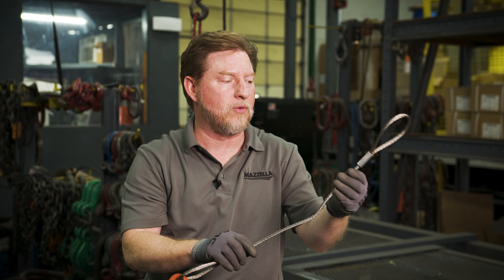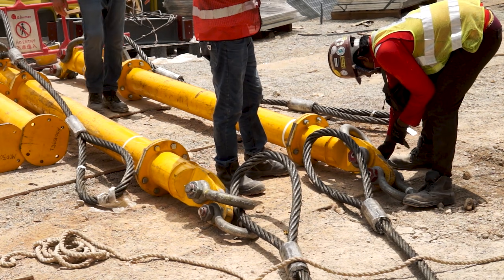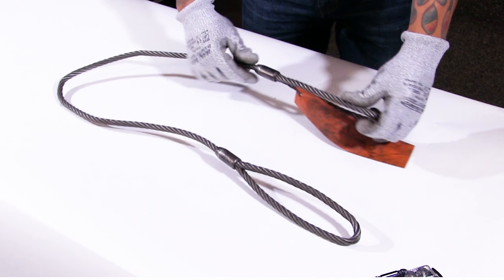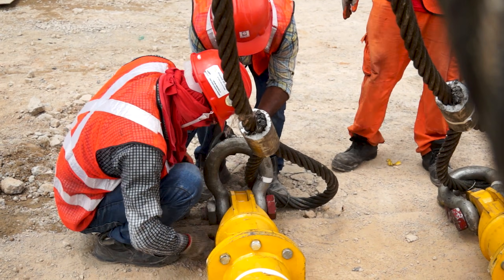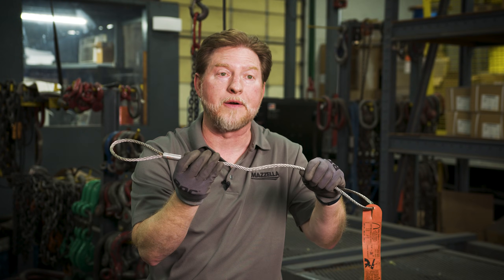You could still achieve a five to one design factor with a fold back. But the largest issue is if you're not doing a proper inspection on this style of sleeve, it may have a tendency to crack or wear if not done properly. Maybe you're dropping large hardware on it out on the job site, and if that sleeve fails, you actually have a catastrophic failure where it's just going to release the load.